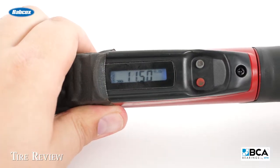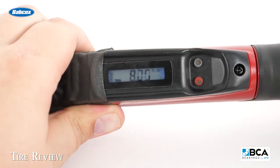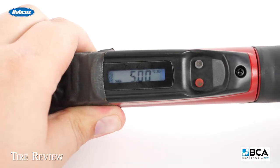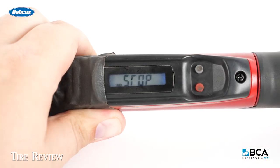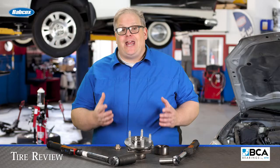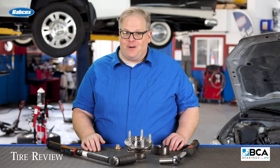Make sure you're using the right torque wrench for lug nuts and axle nuts. No matter the torque wrench, wind it down to the lowest setting at the end of the day to avoid throwing off the calibration. If you leave it at the highest setting, chances are the spring inside will become stretched out and you won't get a proper torque reading. I'm Andrew Markell — thank you very much.